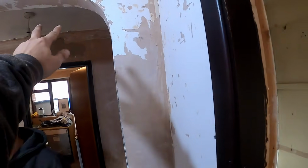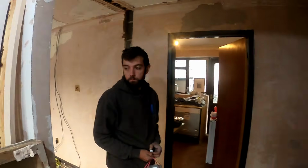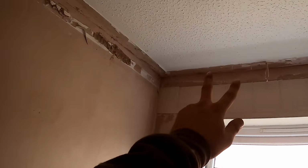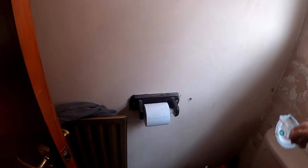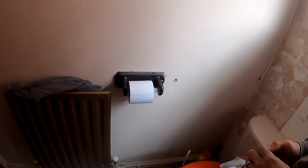I'll only have to take my 22s as far as this, because the kitchen will take 22 as far as the kitchen one, and then the 2 in the lounge will be fine on 15. The boiler's just literally above there, innit? So we can cut this bathroom one in after. Because what we're going to do, just get the shower room done, and then do the bathroom last. Because then at least you've got a bathroom then, haven't you? Yeah, whatever you recommend, mate.